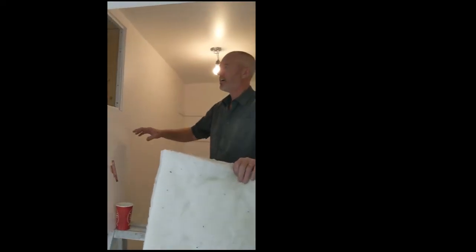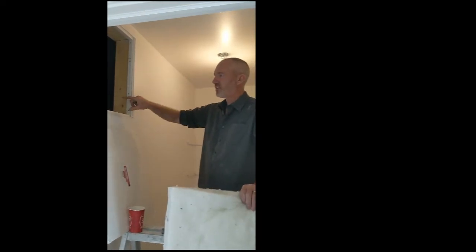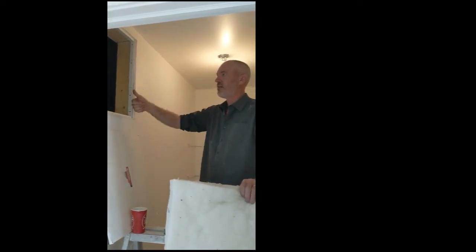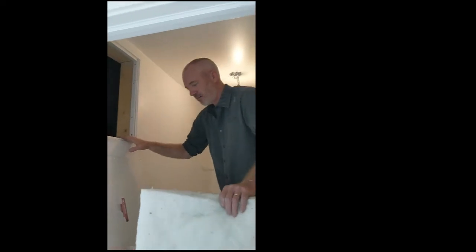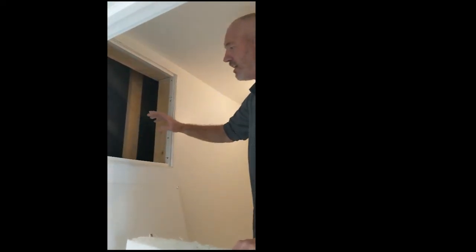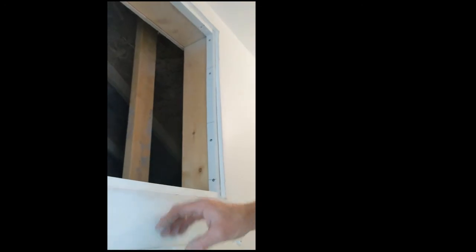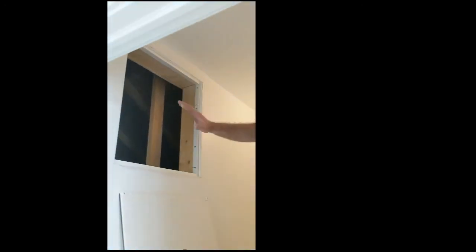Okay so we have a different situation here. The builder decided to have a vertical access into the attic on a lower level instead of having a ceiling access. They decided to put both accesses in a walk-in closet, which is a great idea. We've got a 2x6 insulated wall here with the vapour barrier on, and we've installed the cleats in the same way as the ceiling access. The silicone is right where the vapour barrier is, so once we install our seal panel it completes the vapour barrier. We're going to install a friction fit batt — R20 — which is the same as in the wall.